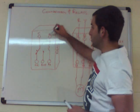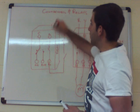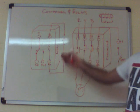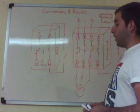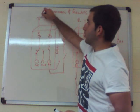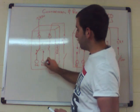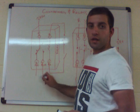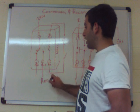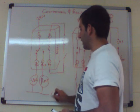For the relay, the same procedure applies — a switching mechanism sends voltage through the coil, operated by mechanical switches, pressure switches, or flow switches. The feed comes from your supply through a circuit breaker, and your devices are connected to either the normally closed or normally open contact. For this example, we'll connect a run lamp and a stop lamp, with the ends connected to neutral.